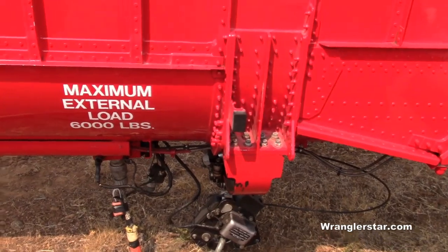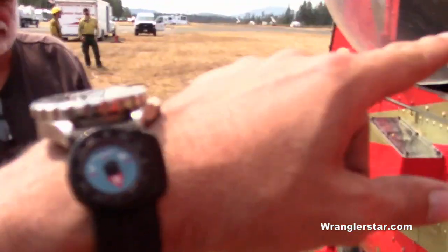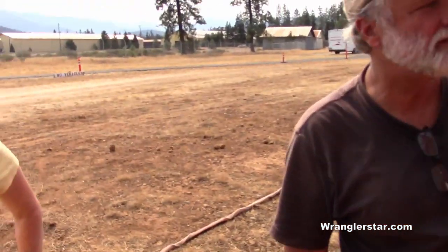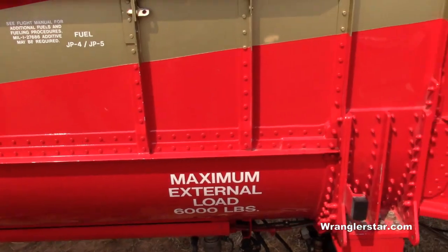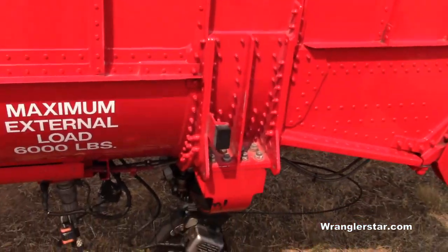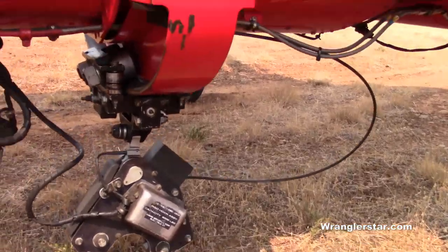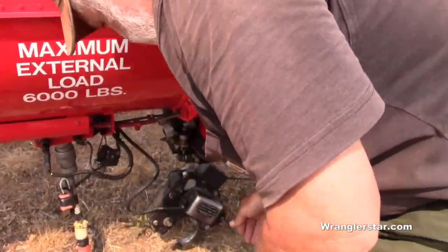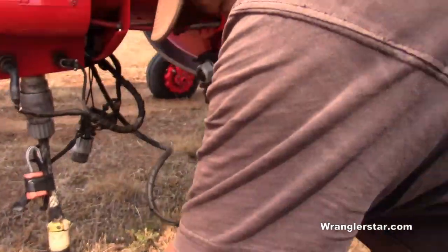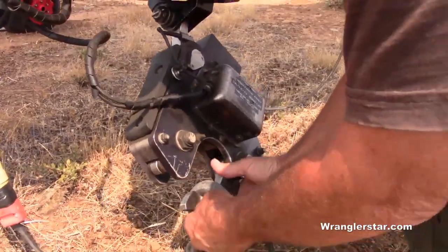The hook slides and puts the pivot point 18 inches below the rotor. Now, the button on the collective dumps the bucket — but do you have a way of dumping the whole cable if you got into trouble? Yes, really simple. If it gets hung up, you can dump the whole load — let go of the entire line and get it out of your way.